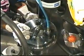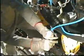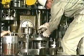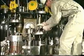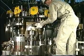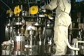Relieve the system of pressure. Disconnect the high pressure hoses, mount protective plastic caps, and place the hoses in the holders. Unscrew the hydraulic tools and, using the spring balancers, return them to their upper position. Return the spacer rings to the holders.